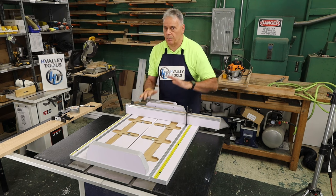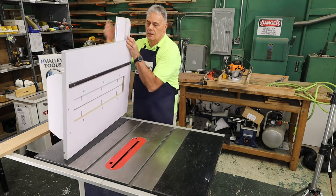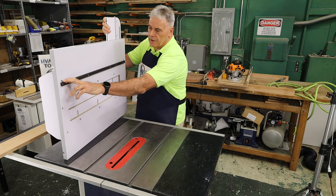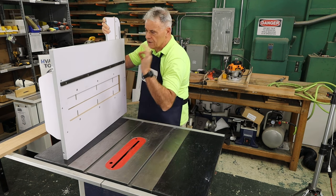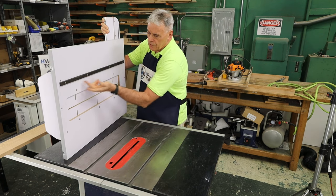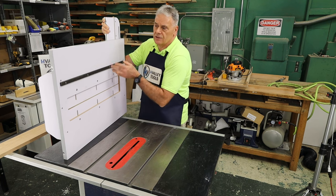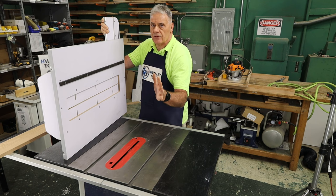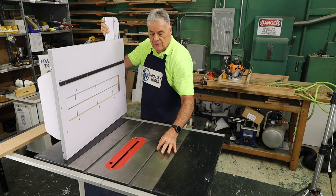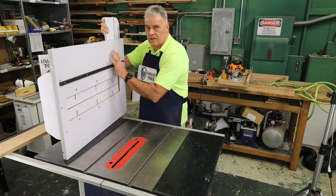A smooth action but not flowing. The reason for that is we have our miter bar here and I really like this bar because it's steel. It's really thick and heavy and there's four spring-loaded ball bearings on the underside. What that allows you to do is it drops into your slot and then automatically adjusts to the width of your T-slot or U-slot. There's always some play in those and these really take up that play.